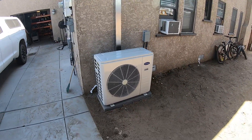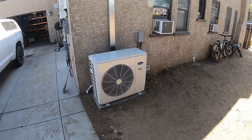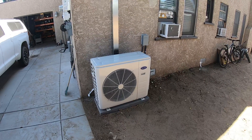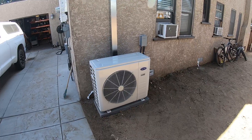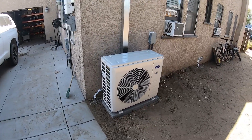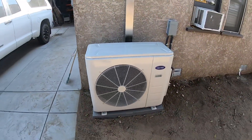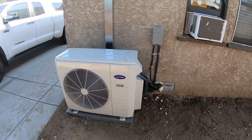Hello, this is Nick with Albert Air Conditioning. Today this is part one of a carrier four-zone ductless split system that we did at a house that has a flat roof with really no attic, so we couldn't do a central AC system. This was the solution — we added four high wall fan coils inside in the living room, master bedroom, the son's bedroom, and the guest bedroom. This unit right here is a two-and-a-half ton carrier condenser. It sits on a 38 by 18 inch pad and is roughly just under 36 inches tall.